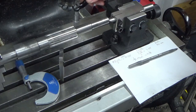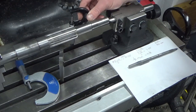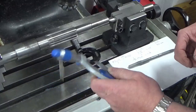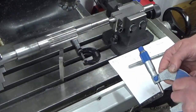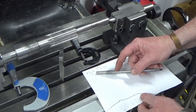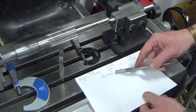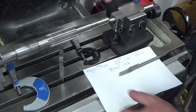of my gear cutter, which is just off camera. Apologies for that, but I hope you can just see I'm measuring the thickness of the gear cutter there, which is 7.25 millimeters, and I've also used another micrometer to measure the overall diameter across the splines, which is 31.07 millimeters. So basically I've taken 31.07 and divided it by 2, which gives me the radius of the spline diameter. I've taken my cutter width and divided that by 2, which gives me 3.625. And now what I'm going to do is bring the cutter down